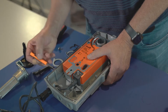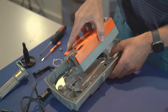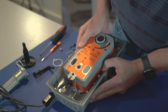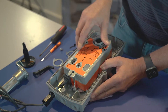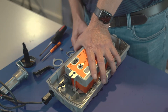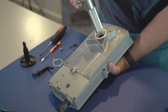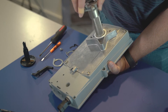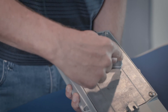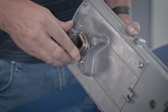On the bottom of the actuator, there is an anti-rotation pin. I'm going to lift that up. I'm going to rotate and spin the actuator over. I'm going to get the mounting bracket on the bottom onto this anti-rotation pin. And now I'm going to flip the actuator back over. When I reinstall this mounting bracket, I'm going to point the U-bolt to this corner — previously it was pointing over here — so now I'm going to point to this portion of the mounting bracket.